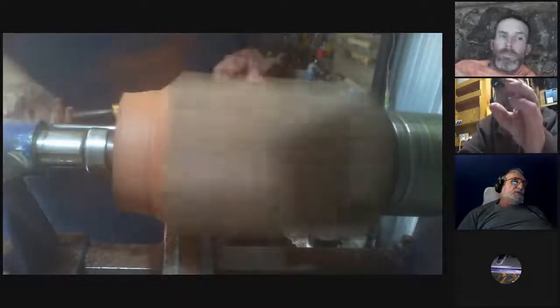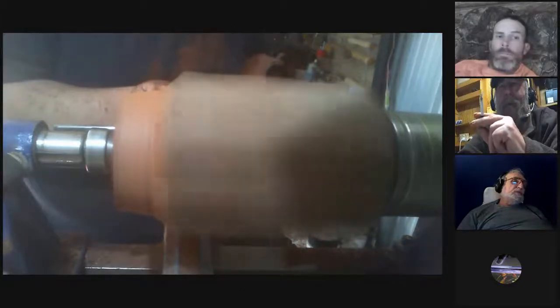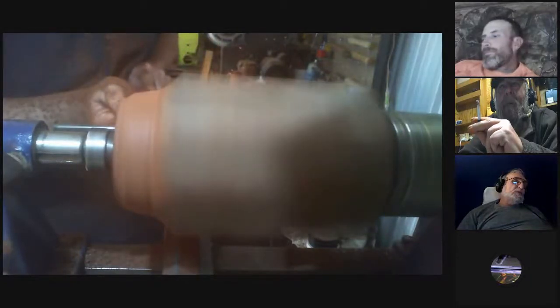Right, just go right to the end, yeah. Right to the tailstock. Now just try putting a half bead on there, all right? We've got to get that chisel action right or you're going to muck up the whole thing. Now you're slowly starting to get it. All you've got to do now is roll the chisel a little bit more so you get a curve in it, not a straight line. Well, that's looking better. Right, keep going.